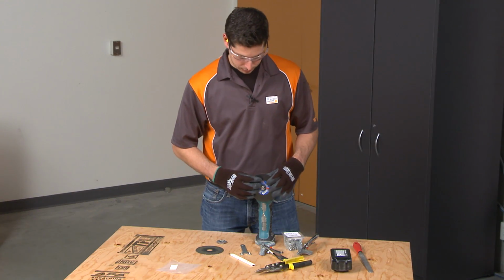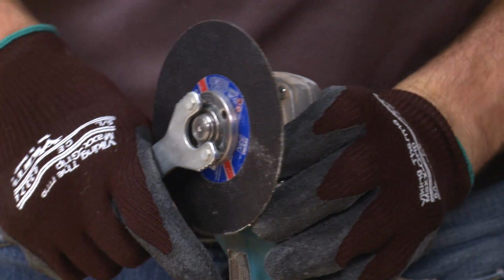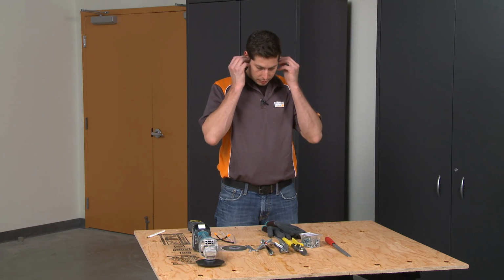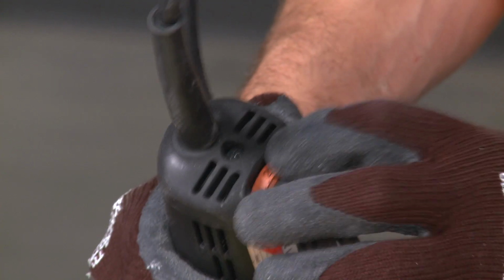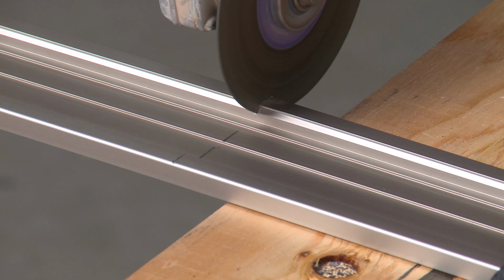The QUADEC-FS is cut using a variable speed angle grinder with the Schluter ProCut TSM cutting wheel. Be sure to observe all safety instructions and standards. Set the angle grinder to the lowest speed. Cut the profile slowly.